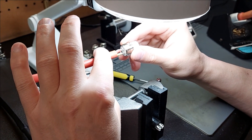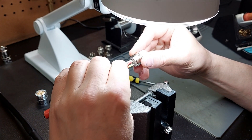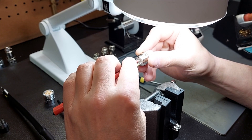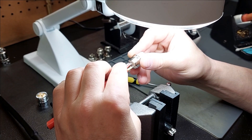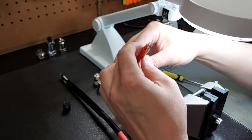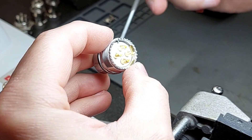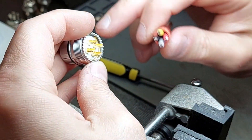When holding the connector, in a perfect world we would solder it so the connector is perfectly perpendicular to the cable, so that once we go to rotate on the connector's casing, it would just screw right on without interfering. Many of you have had problems with that. With these HY connectors — here's the large HY connector that's white — you have the same cups, following that same pattern, giving you the same issue of soldering in an over-under format.